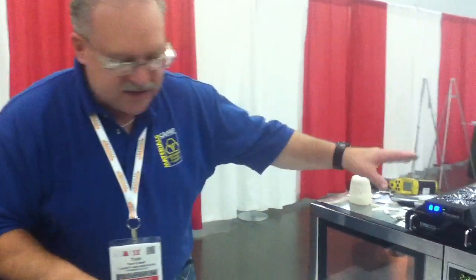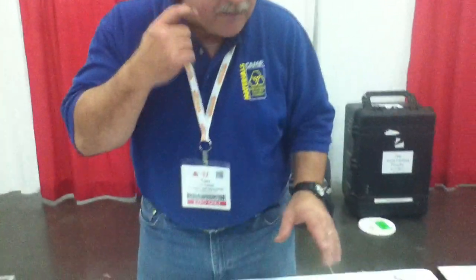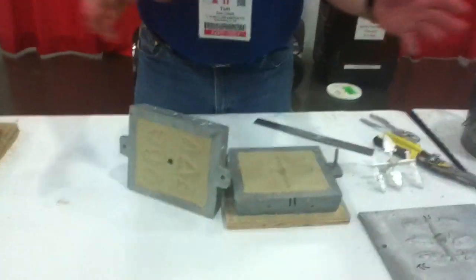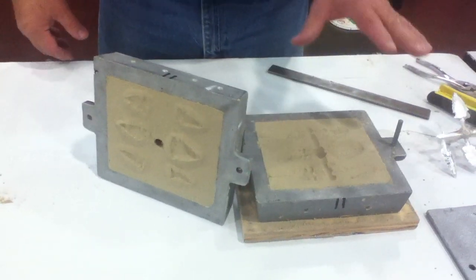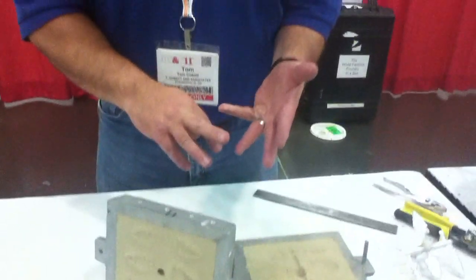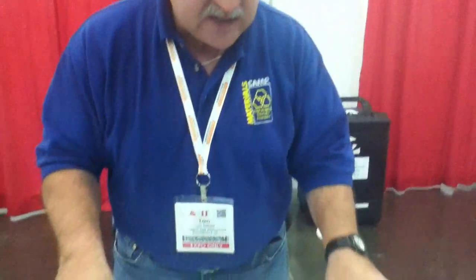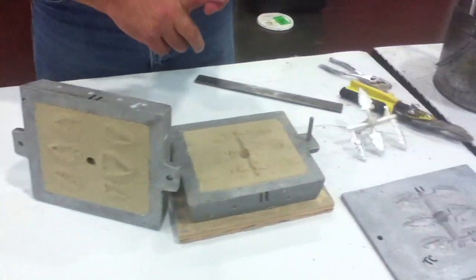This is part of the technology. While this is melting, let's move down the other end — we're going to make a mold out of sand. Sand molds are old technology; it's been around for thousands of years, but we're using a sand that's bonded together with clay that swells in the presence of oil instead of water, and a special non-toxic oil that's a food lubricant, and a couple of other chemicals. The whole mix together is non-toxic, it does not smoke, it's non-dermatitic, and it's completely recyclable — it never dries out. So let's make a quick mold.